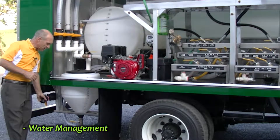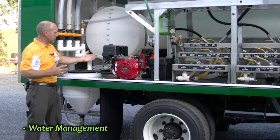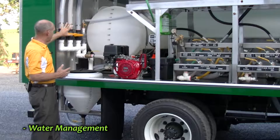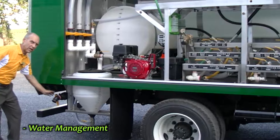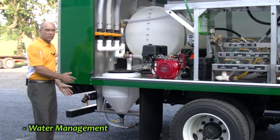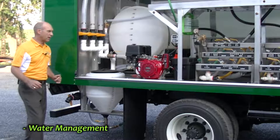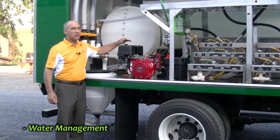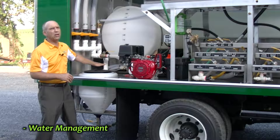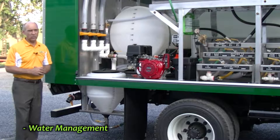So you fill the truck here, you have water in all the tanks, but there's another option with this particular system — particularly since you have the 40-gallon-per-minute pump. You do have a certain amount of liquid stored on all this plumbing. If you come back to this valve and open it, there's a lot of water in there. You can use this water to rinse out backpacks or to wash down a spill. More than that, if you're using the 500-gallon tank as a nurse tank, you have 500 gallons of water on your truck that with the 40-gallon-per-minute transfer pump you can pump off the truck through this fitting to do all kinds of things with clean fresh water.